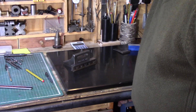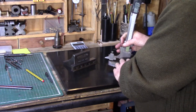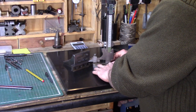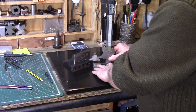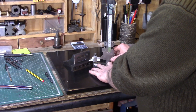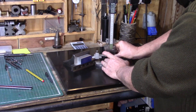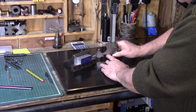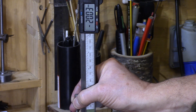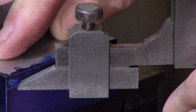I have an old height marking gauge but my eyes are just not as sharp as they used to be, so I have converted it with a digital scale which is much easier to use. I don't have the dogleg scribe to zero the scale to the base, so I make do with a one inch parallel block and zero out the digital scale on there as the reference surface. The accurate height is much easier to adjust compared to working with just the calipers, thanks to the fine adjust screw on the height gauge, and the large LCD display is a bit more friendly to my eyes.